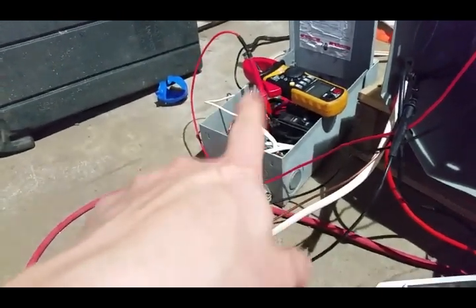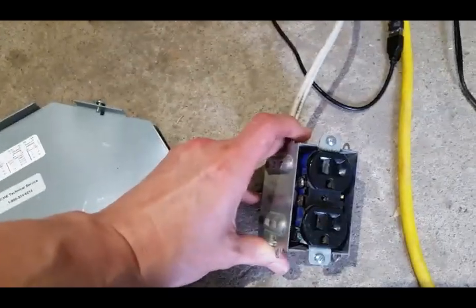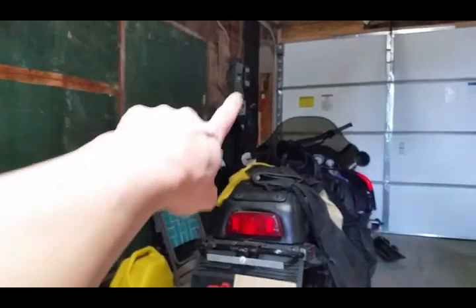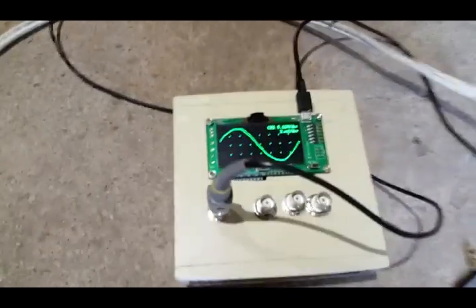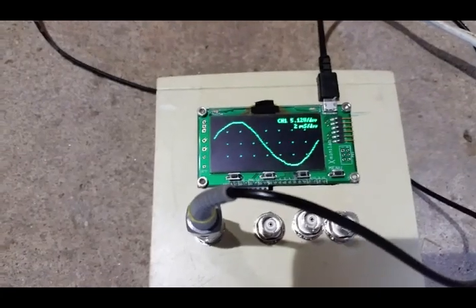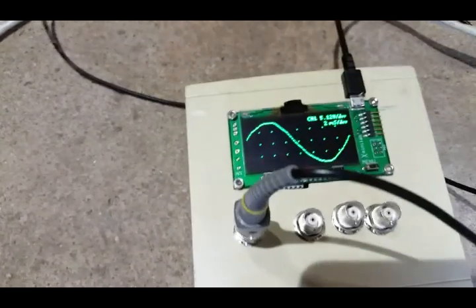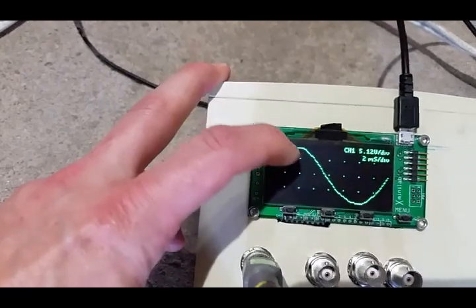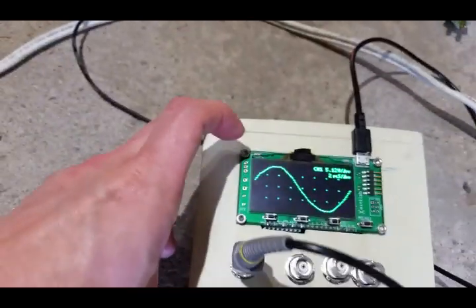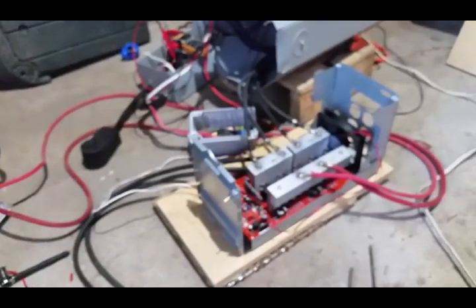I have some breakers in there and it's set up so I have 120 volts coming out, temporarily wired up to this outlet right here. The ground is earth grounded and I have a tie going to my main back box, but just the ground — nothing else is connected to the grid. Currently as a demo, this is what the grid looks like on an oscilloscope that's made out of garbage. I have a voltage divider set up with those lights over there. We get a nice smooth sine wave, though because this oscilloscope is a bit on the cheap end, it's clipped off — that's why I'm using the voltage divider to bring it down. Even with the times-10 probe it still can't show the full sine wave. I'm just slightly under 120 volts — actually at 117 volts right now — and I can change that to anything I want. It shows up as a pretty nice sine wave, though it's got a little bit of noise on it.